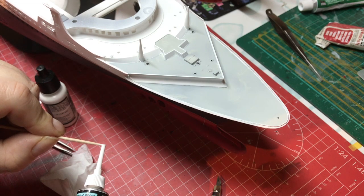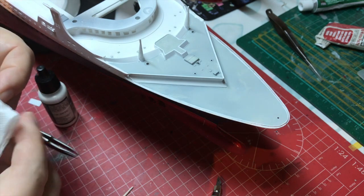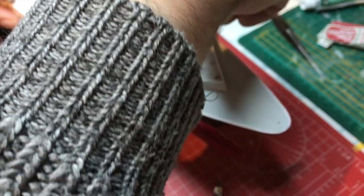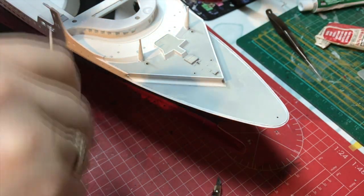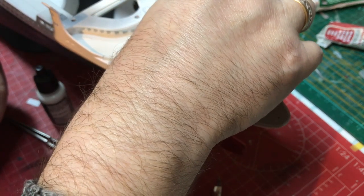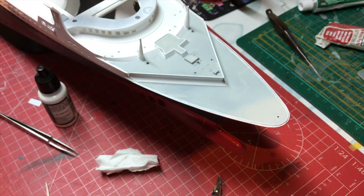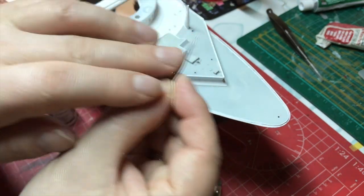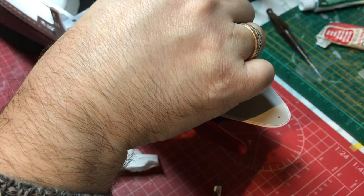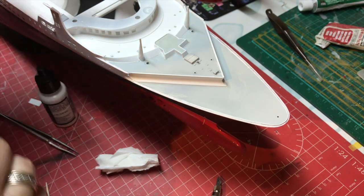Here again, wiping that will be a little bit more difficult so we'll do a slightly different approach. Wipe the excess off first, and then what I like to do is just come along with a squared-off blade that I only really use for filling. If we just scrape it along, we've got a nice sharp 90-degree angle. So that's all nice and filled in now.